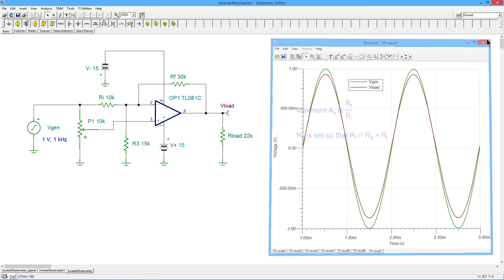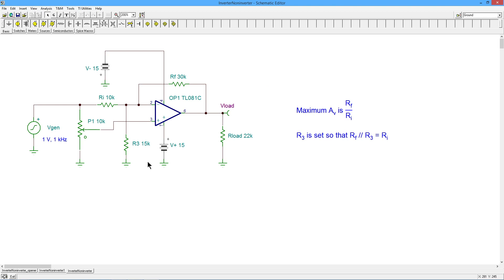I think we've pretty much covered this. This is the general case. If you think about this: to go to a gain of 1, RF and RI are the same size, so the only R3 that satisfies RF in parallel with R3 equaling RI is R3 equals infinity. And in fact, in our first unity-gain version, R3 is simply left off — that's infinity. So you can think of the unity-gain version as a special case. But if you do need a gain of just 1, get rid of R3. This is your general case. All righty, we'll see you next time. Take care.